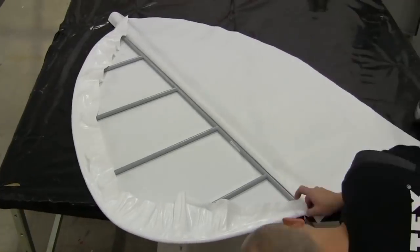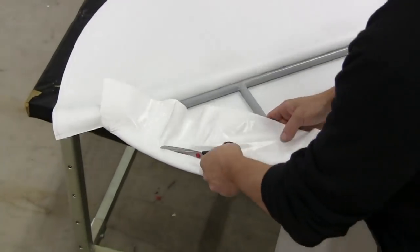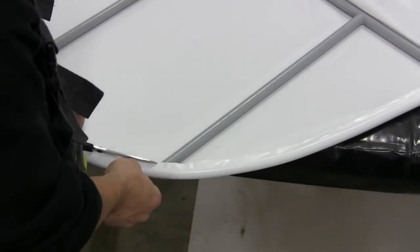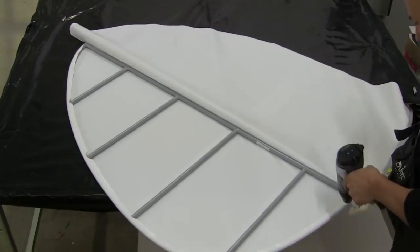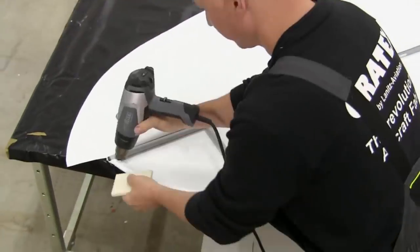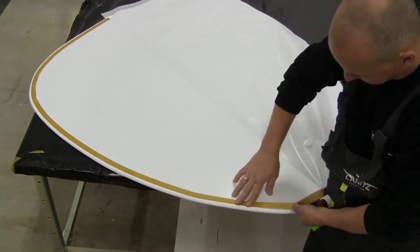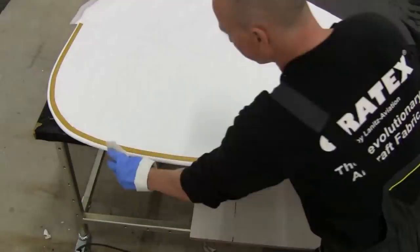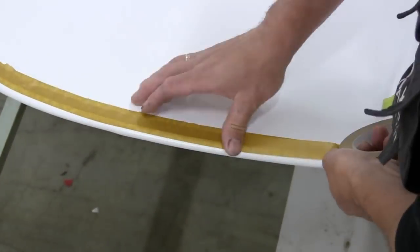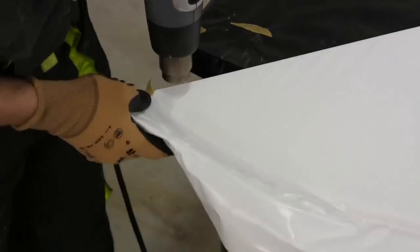Then you bring the two of them together and you take a hot flat iron and that activates it somehow, huh? Right. You've got to let the glue dry first because, as I told you, it's got five active ingredients suspended in water. So you let all the water evaporate out and all you've got left are the active ingredients. Oh, I see. The water keeps it in suspension. Correct. So you've got a medium where you're able to transfer the glue from the bottle onto the component itself. The glue melts and it releases the active ingredients. There's actually a chemical process that takes place that mixes all of those five active ingredients in the glue so that you get a superior bond once the glue is properly activated and cured.